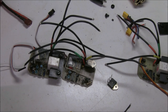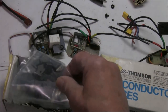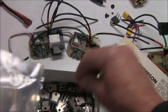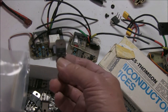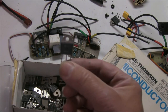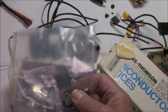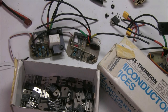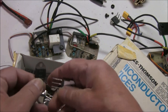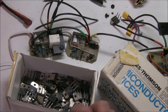This one had the power transistor blown out — the BD250A — which goes in there. I went through my old stuff and found a large box marked BD250. In fact these are TIP36As, which are really the same as the BD250. That one's a BD250 and these are the other version — BD249s or TIP35As. I've still got quite a few of those from the late 80s and early 90s. The heat sink shape is slightly different from different manufacturers — square one, round one — so I can put one in where it's blown.